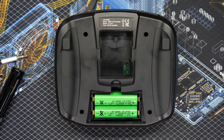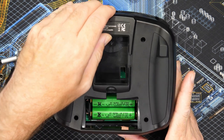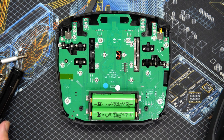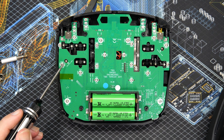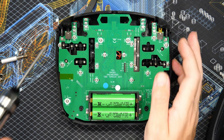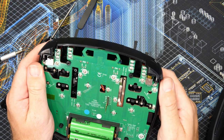To get inside this radio you need to remove the four hex screws on the back, after which the case will very easily lift off. There are no wires between the back of the case so don't worry, and you can even leave the batteries in place. Inside you'll find the adjustments for the gimbals — the throttle adjustment on one side and tension adjustments on the other, as you would usually be able to do. You can simply tighten or loosen the screws to adjust the throttle tension to get it how you like it.